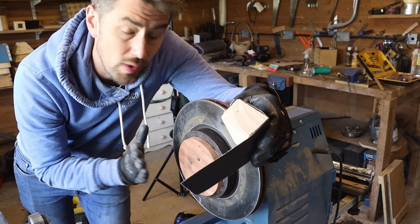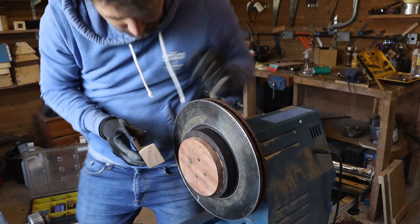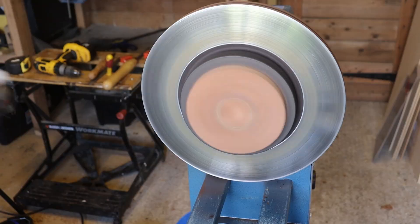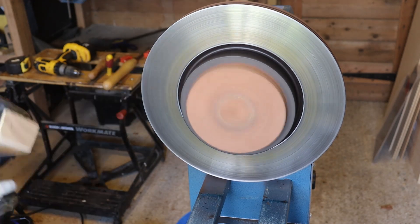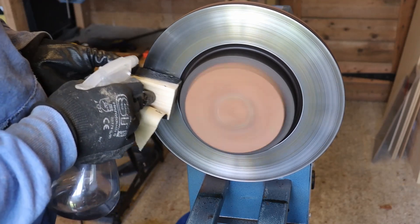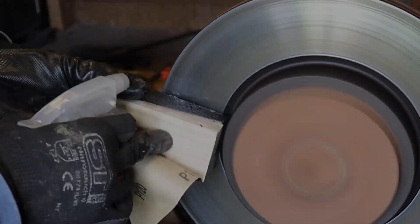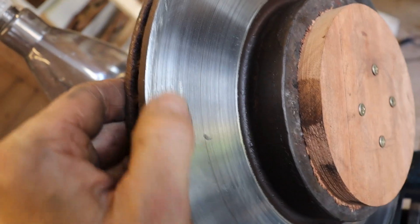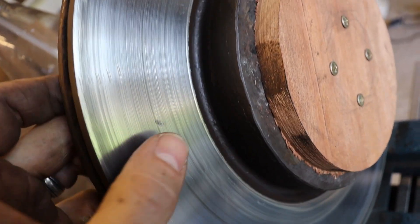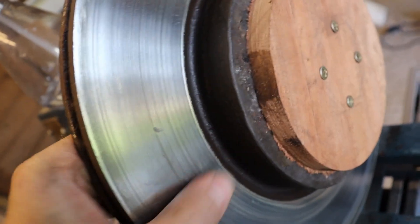At this point I've got this lip off. The surface has some very minor grooves from the wear of the brake pad and I'd like to get those flat if I can. So I'm going to switch to wet and dry paper — this is 120 grit on a block of wood to give it a nice flat side — and I'm just going to hold it on to take off the high spots. The wet and dry paper wasn't really that effective, mainly because it was not intended for metal grinding; it was just some spare I had in my toolbox. So let's go back on the flap disc sander and see how we go.